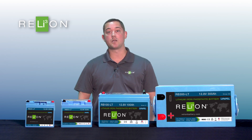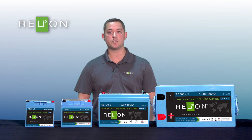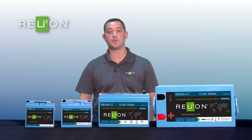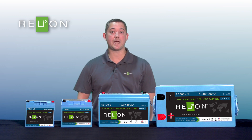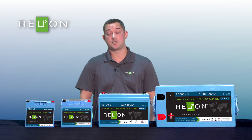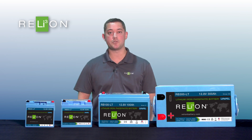There are a few ways that companies get around this. One is to have an external heating element that heats the battery up so you can charge at whatever rate you want. Another is where the BMS actually disconnects the cells from the pack so you can't charge the battery at all. Or you can have communication built into the battery and the charging device that is temperature-compensated, and it charges at the appropriate rate based on the temperature.